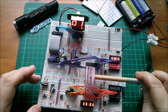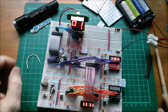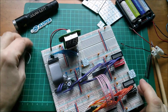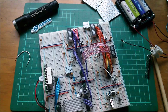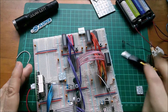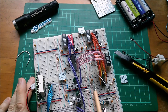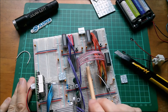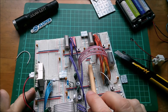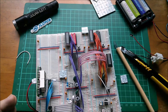For this one down here I'll probably pull that white wire out — of course that's going to stop the address decoder from working — and I'll power it off. I'll take these four links out. This board not only replaces these four links, but it also replaces any links which bridge the two power buses together, so it replaces these two links as well.